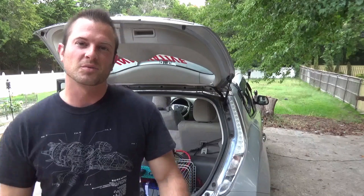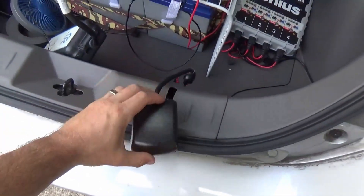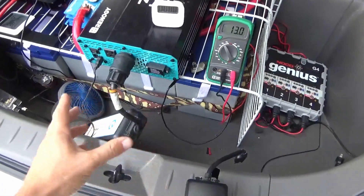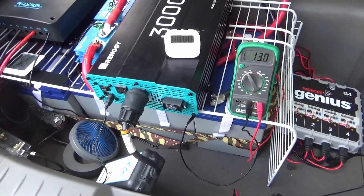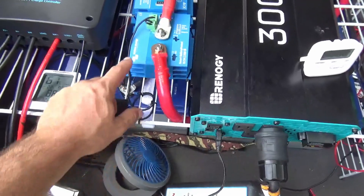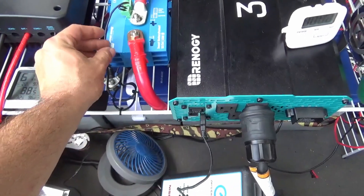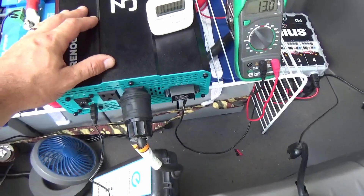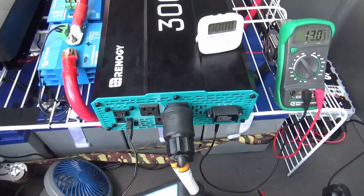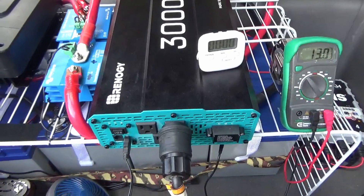Hey guys, thanks for watching. I want to do a quick update video on one of the improvements I made to the system. You probably remember last time we ran this, we were using our little charge timer to balance out how long the system was running against how much voltage we were getting in from the sunlight, to make sure the batteries didn't get depleted too much. I had tried to run it through one of these smart battery protects, but the inverter — this constricts the current flow through there — and the inverter has a safety in it, but if it's not getting enough current it will basically cut itself off and that little yellow light will pop on.